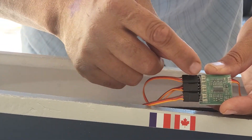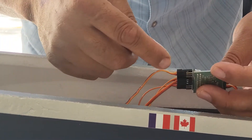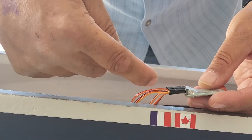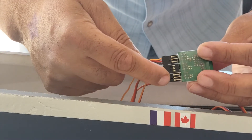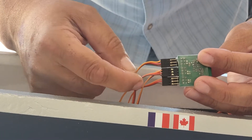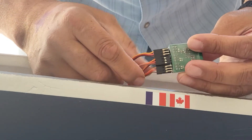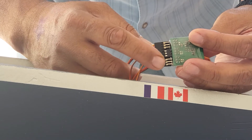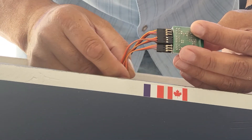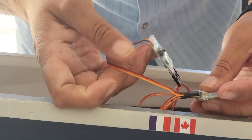This one over here at the end is where the door opens, the retract comes down, and the door stays open. There are two rows of pins on there — the top row is where the pins are sticking out so you can connect the servo. If you look at the bottom, there's only one connected down there in the middle — that's where the door opens, the gear comes down, and the door closes. The retract controller connects to the sequencer, so there's nothing there, and then in the front is the one where the landing gear door opens, the retract comes down, and the door stays open. That's why there's a pin available here and a pin available there.